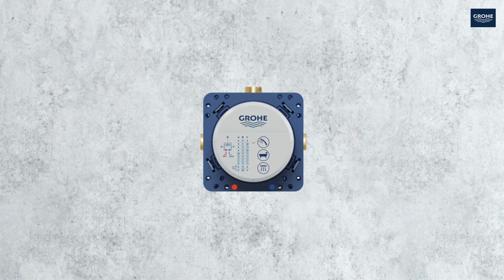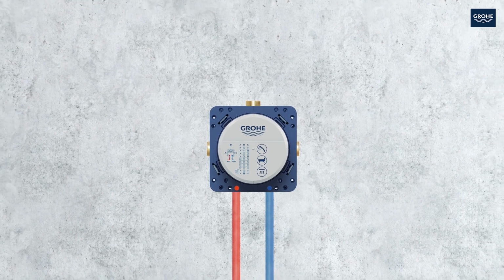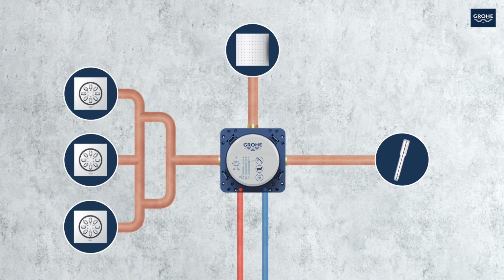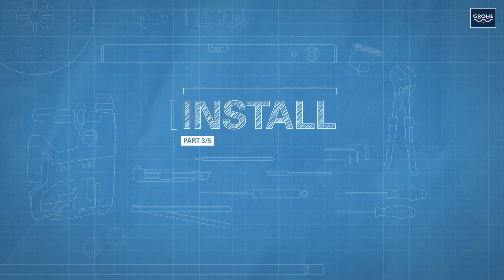When connecting the pipes, consider what the smart box is going to be used for later. The connection diagram differs here depending on which components are to be connected. In our example, this is a showerhead, a hand shower, and 3 body sprays. When installing body sprays, we recommend installing them with a balancing loop, which will ensure that each spray receives equal flow and pressure. Let's move on to the final assembly.